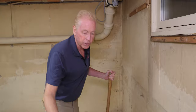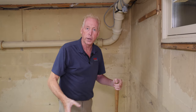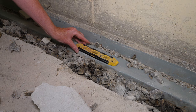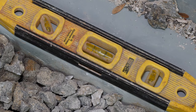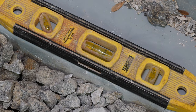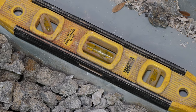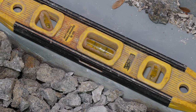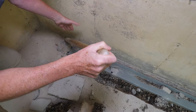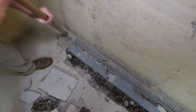You can see where the drain is — I'm always focused on where your drainage is because that has everything to do with how dry you can get your basement. Look where this is: if I put a level on this thing, you'll see it actually has reverse pitch. This end should be higher so water flows through it toward the pump. When I lift this end up, the bubble just comes to level — meaning the way it's installed, it has pitch going away from where the pump is. I'm going to pull this out and see if we have any moisture or water underneath where the gutter is installed.